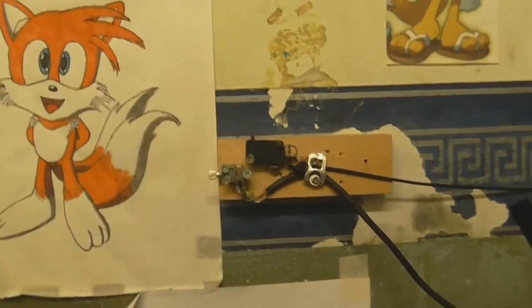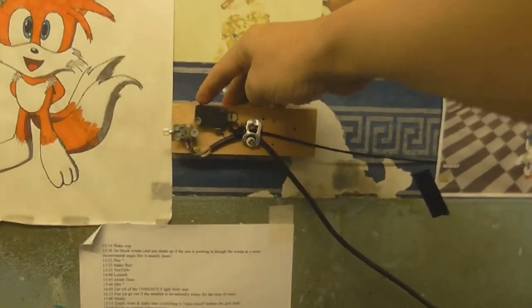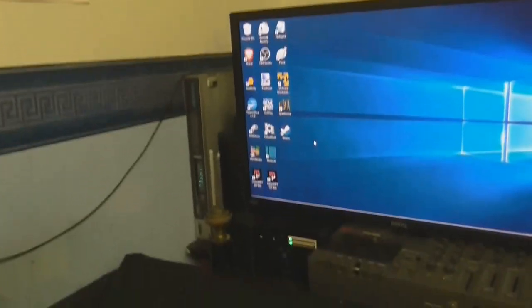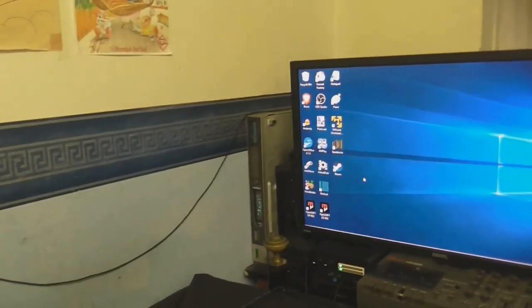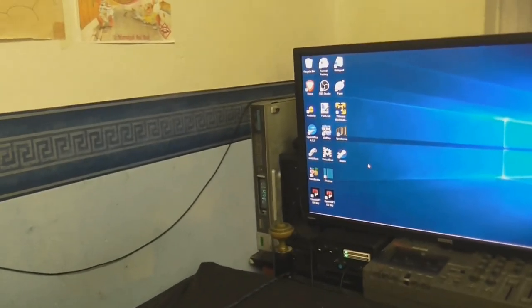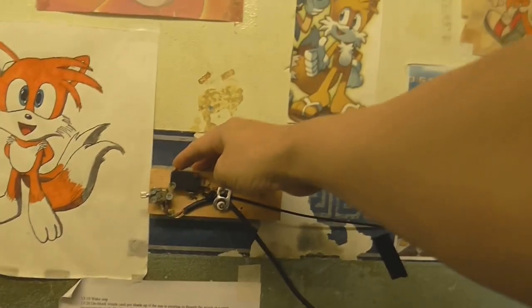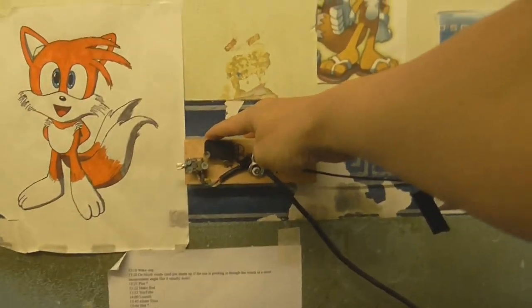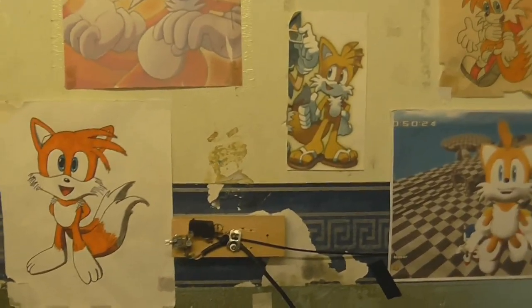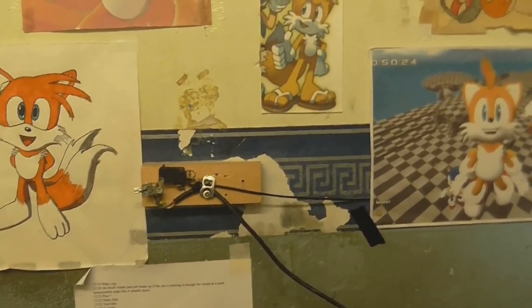Got a couple of little controls which I can adjust easily from my bed. So, this is the volume control, an external volume control that I built for the amplifier. And this micro switch is connected in line with a relay that's in this timer. And I've set that relay to come on at a certain time. The time that I usually get up. So, when I wake up and I press this micro switch, if I don't hear the relay click, I know it's not time to get up yet. But if I press the switch and I do hear the relay click, I know it is time to get up. That way I don't have to wake myself up, open my eyes, look at the time, and then have trouble getting back to sleep.